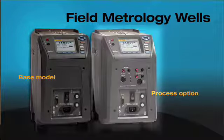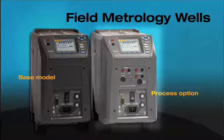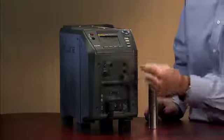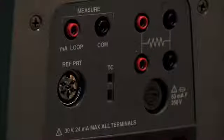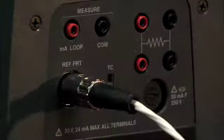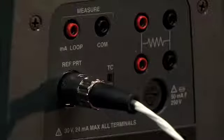If you want to upgrade to the process electronics, we take many of the tools that you would use in a process environment and combine them into one instrument. You can see many of these front buttons here on the front of the instrument — these comprise our process electronics. We have the ability to read a reference thermometer probe that accepts ITS-90 coefficients, so you can improve your accuracy by using the process electronics.